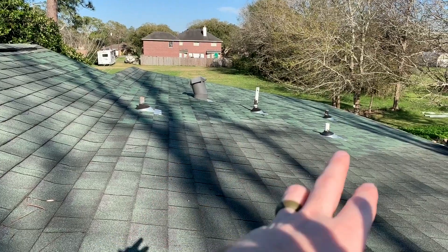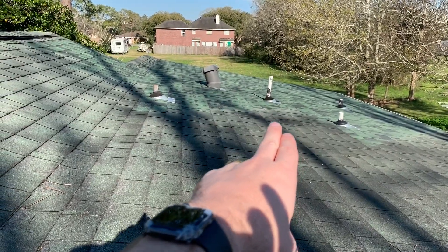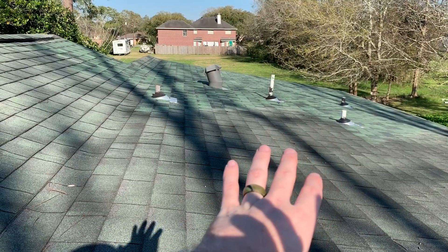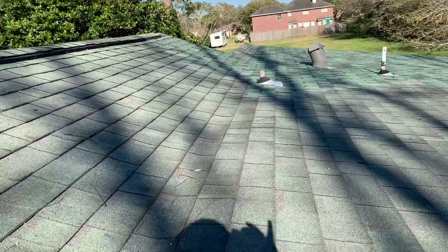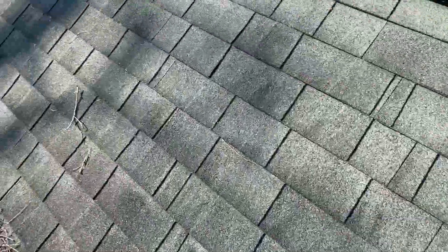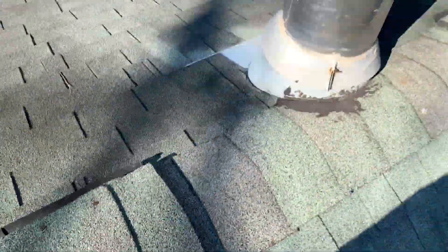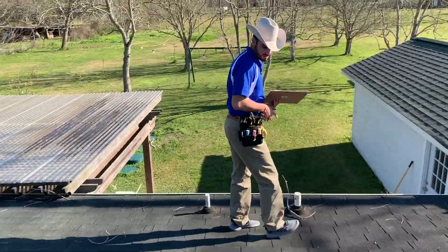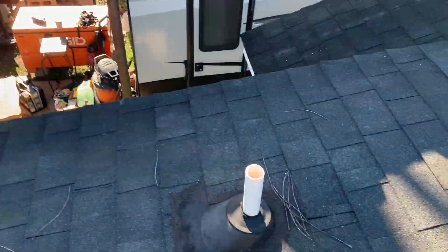Not sure about much over here — it looks pretty decent. Some transition areas are not connected very well; you have old shingles hitting new shingles that aren't tarred down well, so those need to be fixed. That's a basic roof tune-up, which is necessary on this roof. You've also got some exposed nails over here that just need a nice bead of caulking on top of them.